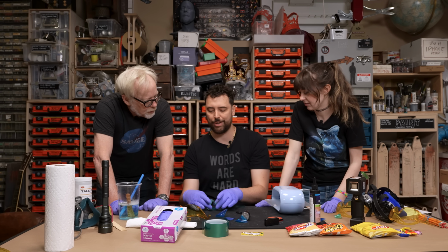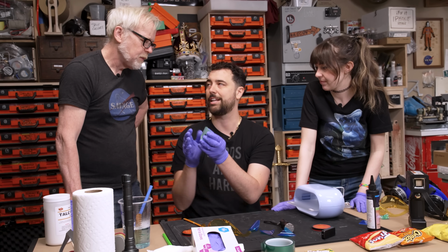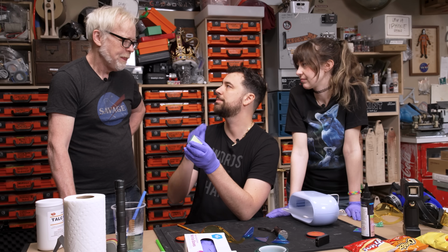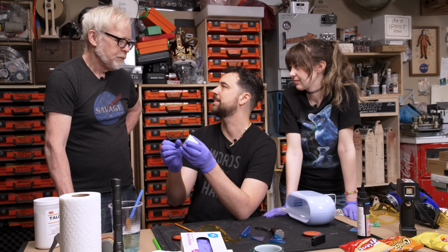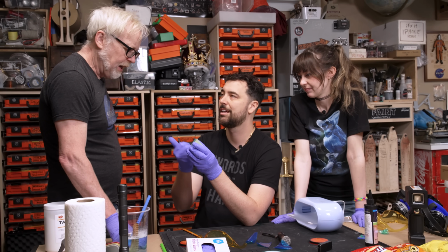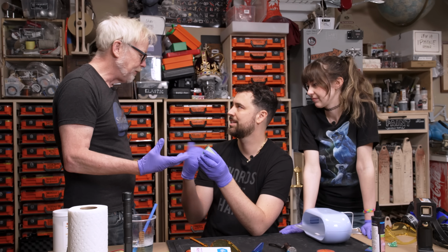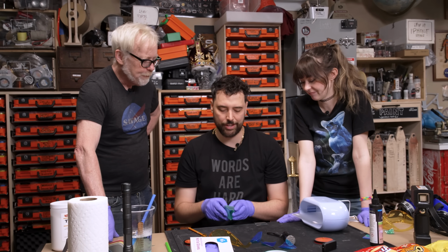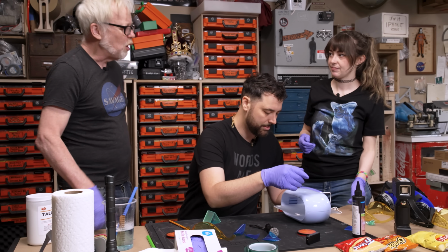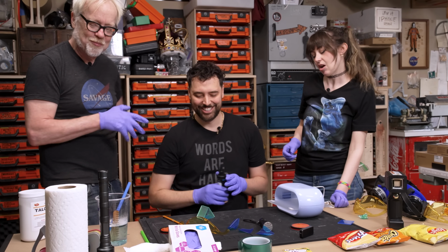I wanted to create a situation right here, because this is a situation that we faced. If you wanted to glue this together with, let's say, acrylic glue, you need a full smooth surface contacting another smooth surface in order for them to melt and rebond together. And with CA glue, that's going to off gas and mar your optical surfaces. Whereas the UV resin is nicely clear. And you were saying you can go in and do like 3 dots to tack it and then go in and that's really neat.